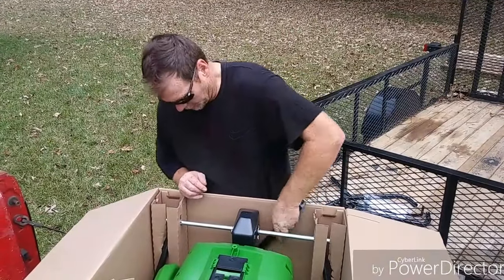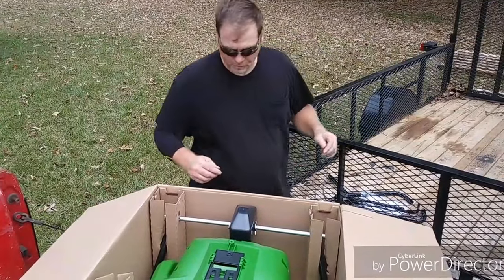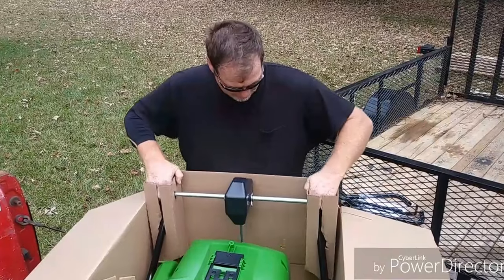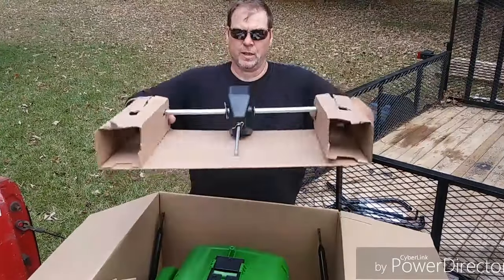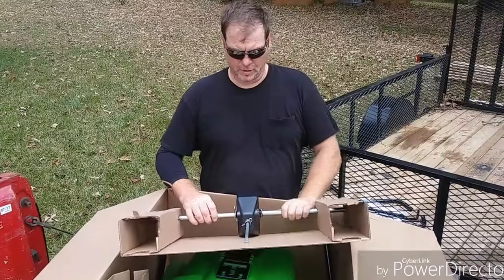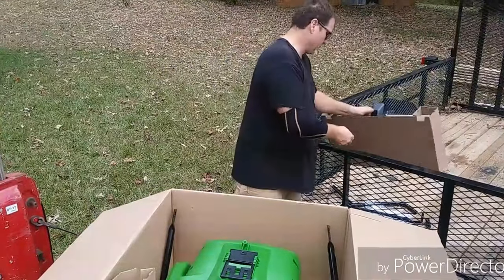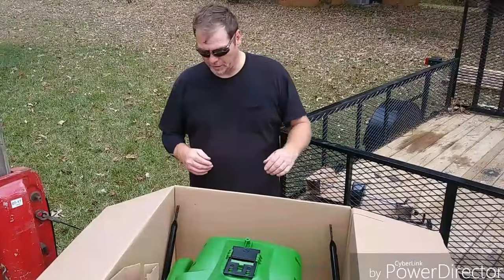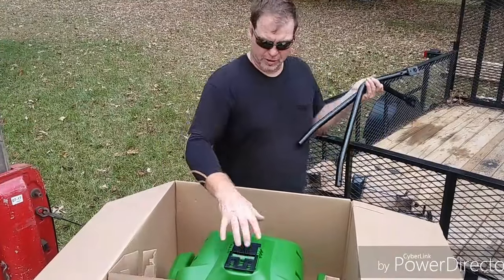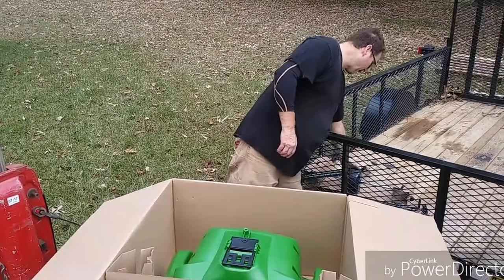We're almost down to the last of the loose parts floating around inside the box before we pull out the hopper. There's your drive axle. Both sides are locked in, instead of like on the hand push where you've only got one side pushed in — when you turn right, you stop spreading; when you turn left, you continue spreading. On the hand push it just piles up on the spreader wheel, and you don't get a good even application.